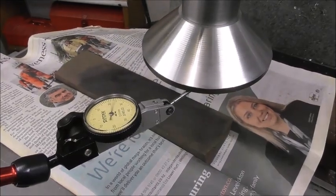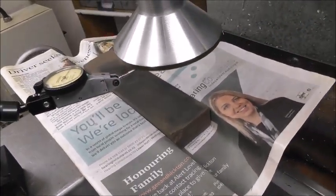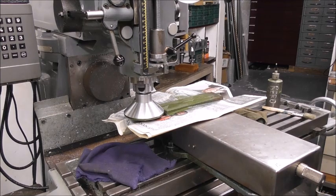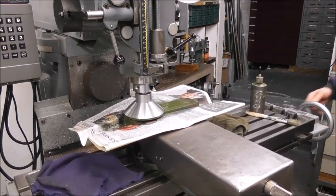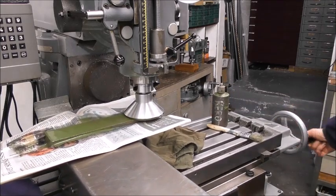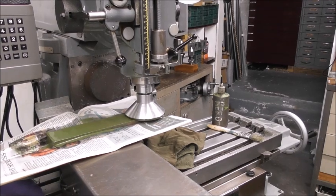This wheel has got a run-out of about 0.1mm on the face — about four thou. We've got an oilstone in the vise and we're running it really slow. I've got an old woodworking oilstone for sharpening chisels and plane blades, and we've got the diamond wheel which had a four thou run-out on the face. You can hear from the noise that it's cutting evenly — it was cutting intermittently — and you can see from the colour that it's removed some of the diamond wheel bonding.